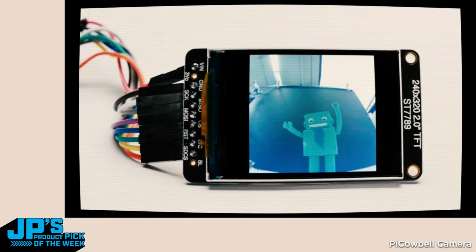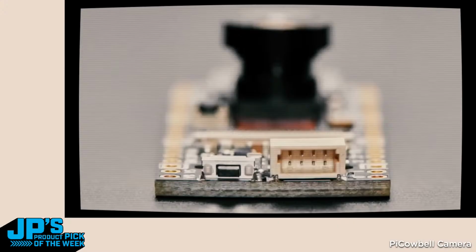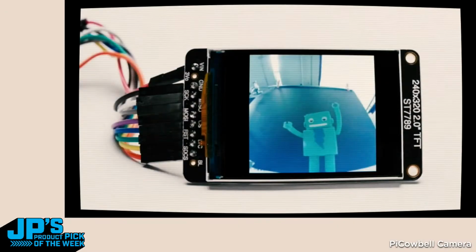So these come in a variety of different lenses, and each lens has like its pros and cons. So the first lens is like the biggest. It's the 160 degrees. So this is very, very wide angle. So if you see the photo, like the figurine in the center is very small, and you see like a very wide image, like a 160-degree image of the background, but it's kind of distorted. Like you see things are sort of at the edges, they're curved because it's got a distorting lens, it's like a fisheye lens.